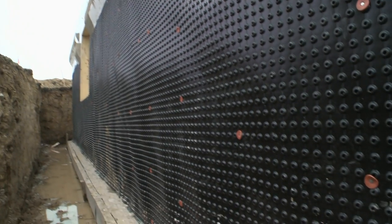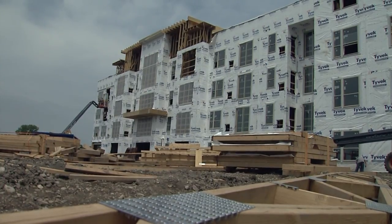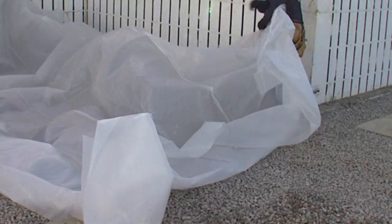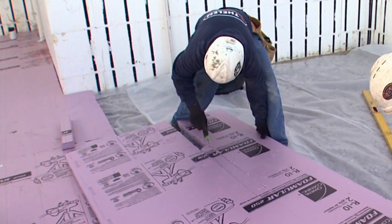This is like a drainage fabric, so the crinkly side would go up against the wall, and the other side goes up against the insulation. If you get any water behind there, you're going to have a waterproofing membrane on that foundation to keep the water out. This drains it down into your weep tile, or if you've got daylight, it takes it out on the outside. And then even underneath the slab itself — if you want to have a nice finished basement with carpet or wood flooring — you don't want all that moisture coming up through the slab, so you put a control layer underneath it, most of the time some kind of polyethylene sheet.